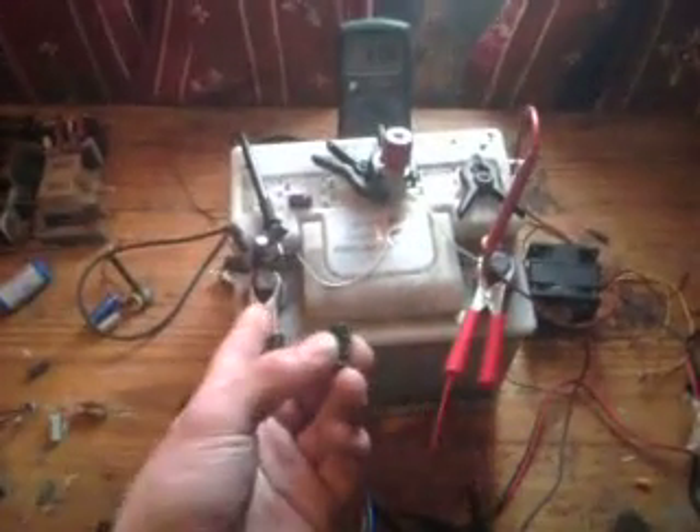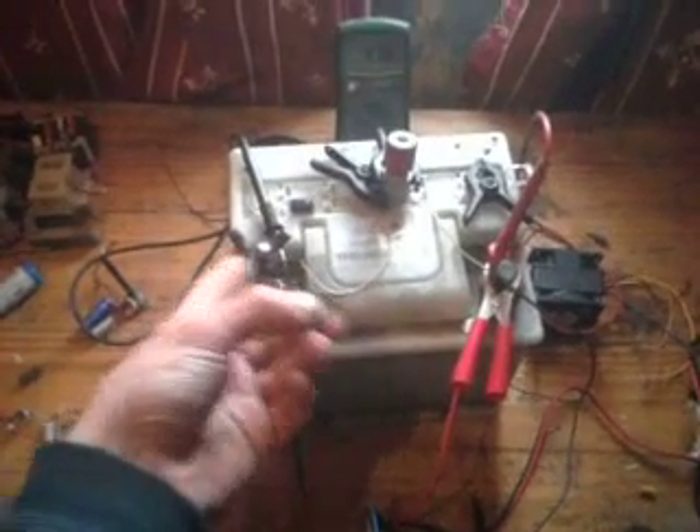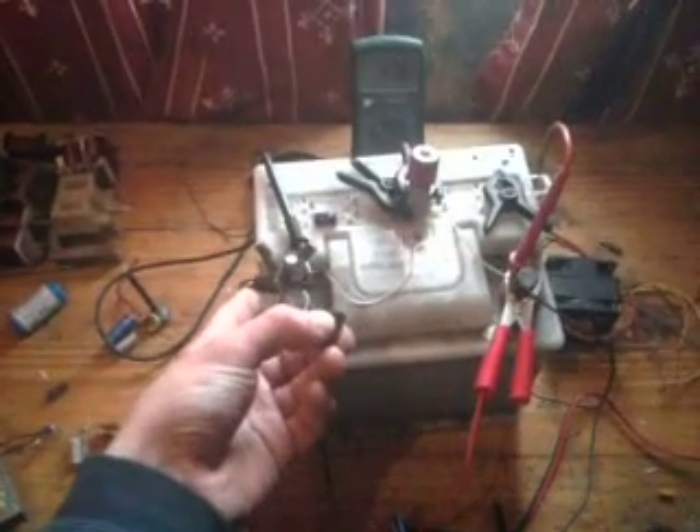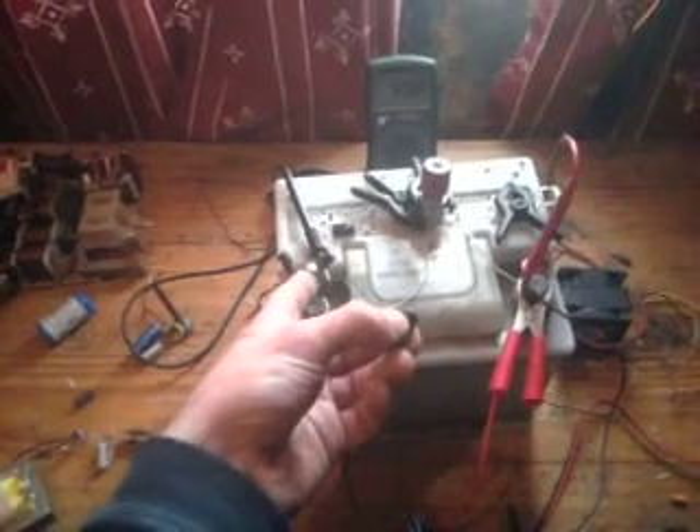Overall I think 1,000 microfarads is quite an adaptive amount. It's got a high current draw, so you want about six or seven of them in parallel, or more. Collectively, this is over 2,000 microfarads. But this motor will run just the same from the 1,000 on this side or the collective three times 470. It'll run exactly the same.